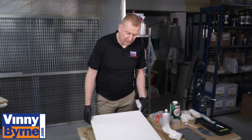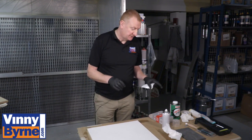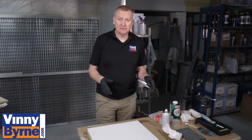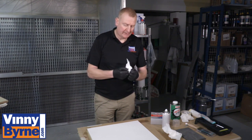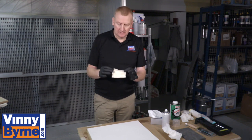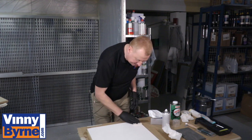So now we've prepped the surface and we're ready to move on to the next stage, which is the painting stage. As I said before, this can be applied by paintbrush and roller, but today I'm going to be using a spray gun. Also, as I mentioned, a tack cloth — I'm going to use one of these just before I start painting. All it is is a cloth that's impregnated with a glue and it's designed to pick up any dust that may have landed on the surface after you've cleaned it.